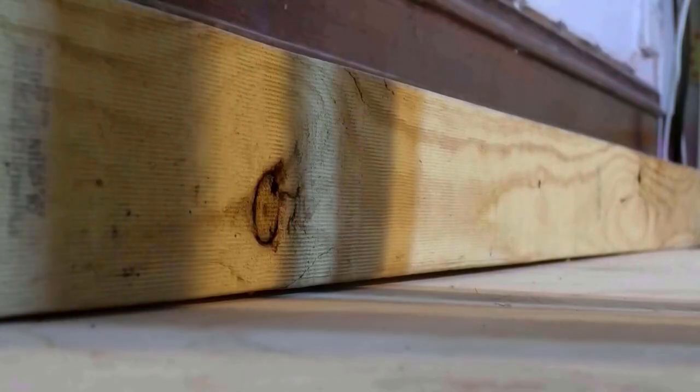Okay, now we have to make another rectangle, a smaller rectangle on the inside of the platform. So put your timber frame up against the other line and draw a new line, like so. Okay, what's going to happen is your frame is going to be sitting on this line, not the outside, okay, on the inside. Do that right around the whole of the platform, but don't touch the inside going crossways. Okay, now this is what it's supposed to look like.